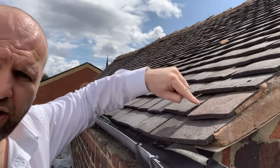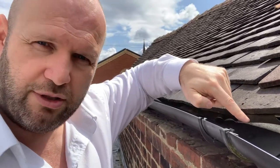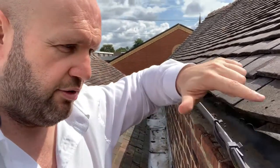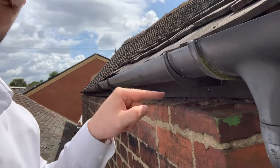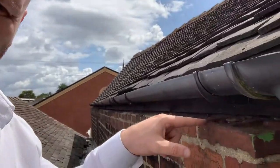So there's me on a roof. To recap: the water runs down, some finds its way through the cracks, and underneath we need a second layer of defence — the felt. Sometimes it's the old Slater's felt, sometimes the new breathable stuff; the new breathable felt is your second layer of defence and should go into the guttering. If that perishes, water will get underneath your corbelling — if your house has corbelling — and then it has an easy way inside, running between the brickwork. That's generally how water gains entry under the first metre of felt.